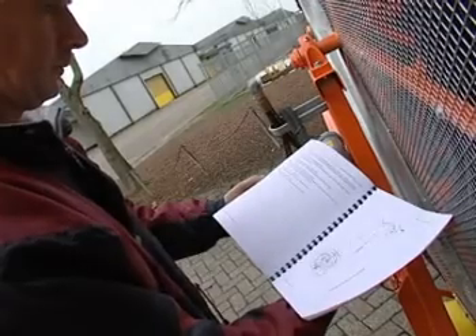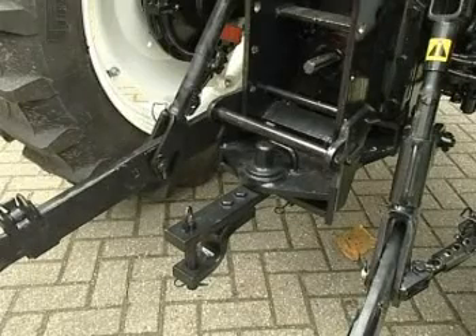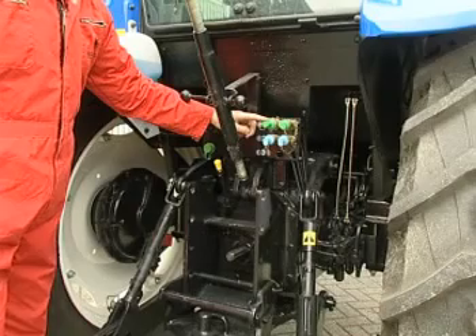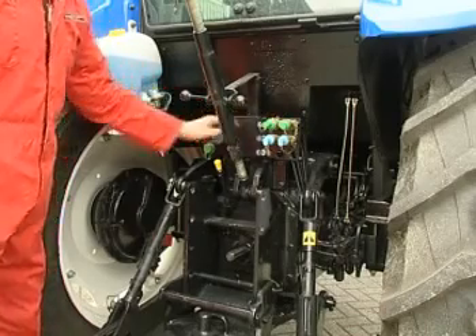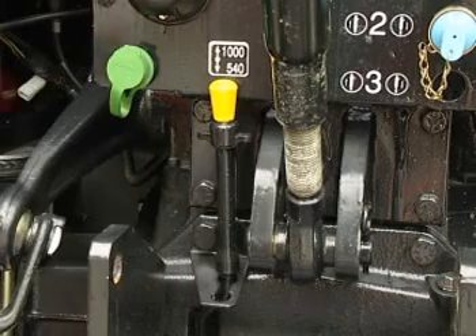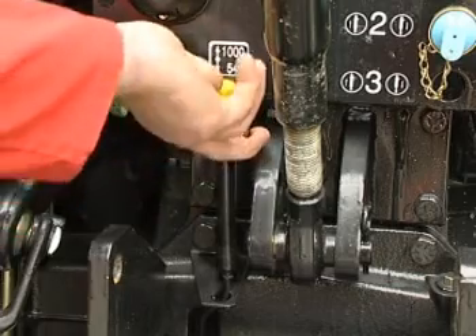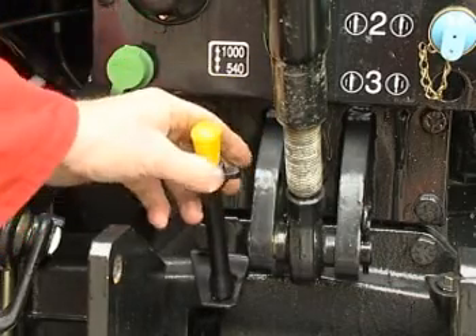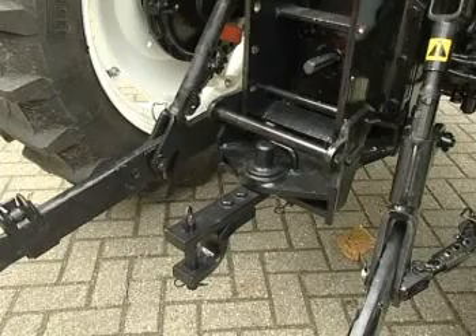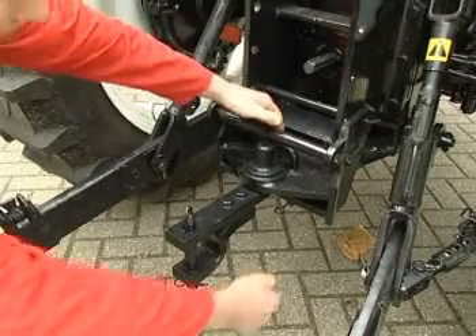Your tractor must be equipped with a reliable three-point hitch to carry your drain cleaner. When using the types Junior, Delta, and Senior, you also need a hydraulic pressure and return connection. The required coupling shaft speed is 400 rpm, so always use a 540 rpm shaft that runs at roughly 400 rpm at reduced engine speed.